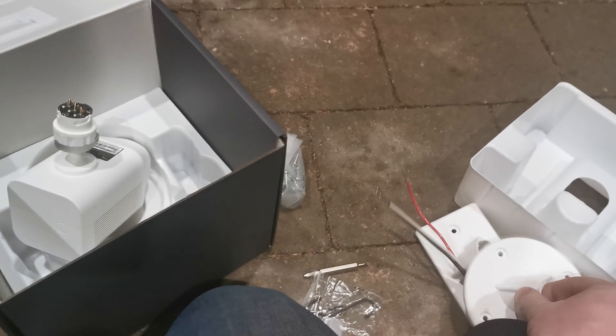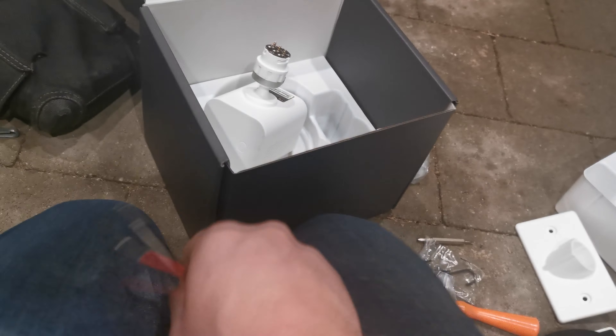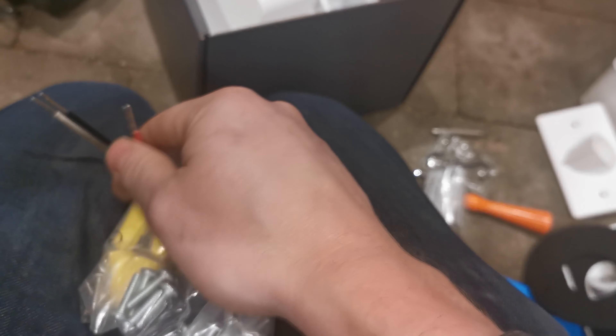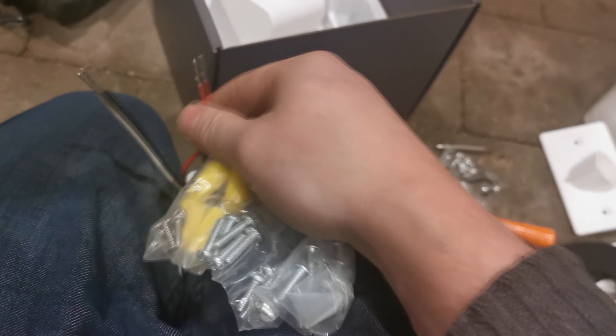Leave the camera down here and let's go up to our box — we're going to wire this in. If you don't — 99% of you are not going to need this red wire. What I suggest doing before you even go up there is cap it off. This red wire is for additional spotlights, so it would activate the spotlight if somebody walked by.